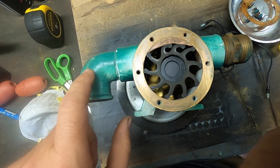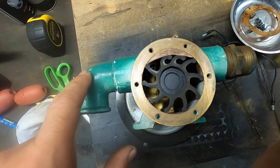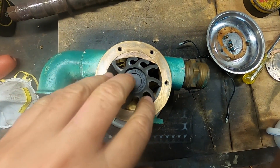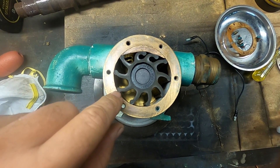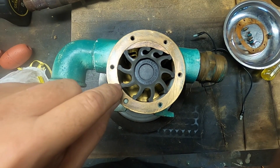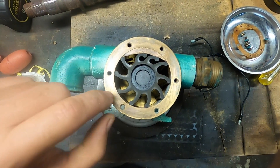And obviously an inlet and an outlet. The way you know which way is which — water doesn't come across the top of the pump. It comes in this side, around the pump, and then out. When the impeller is pushed into the pump housing, you can see the blades on the impeller are bent very slightly. This ensures they seal well against the outside surface of the pump housing, even as they start to slightly wear over time. As they wear they'll get a little bit shorter, but because they've got this curve on them, they'll spring back and maintain a positive seal.